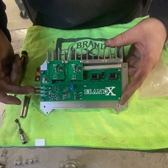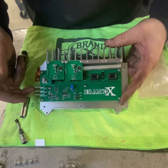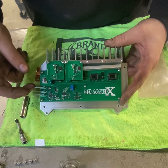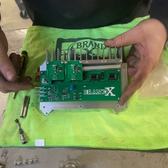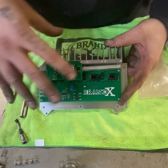Your second pin here is a ground pin — that's just going to be ground somewhere on the chassis, battery, or alternator — and you have your ignition turn on. You don't need to necessarily use an ignition source; you can use a switch if you feel so. Just know that if you do that, you're going to have to remember to turn the switch off, as this will stay on otherwise.